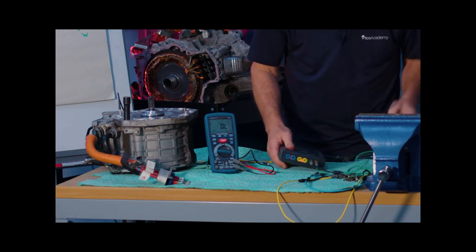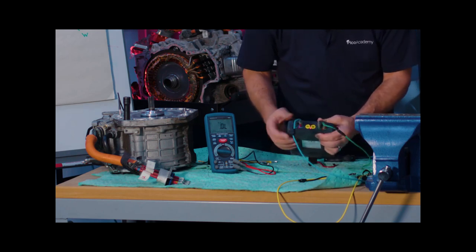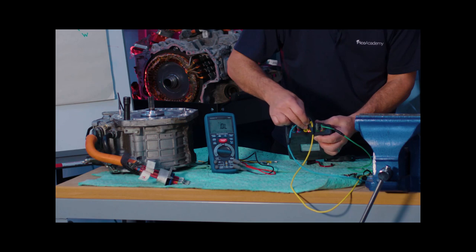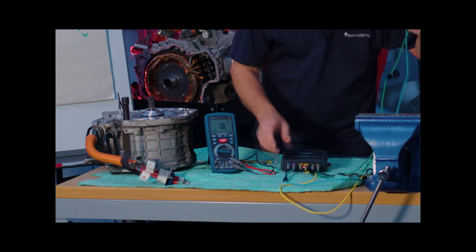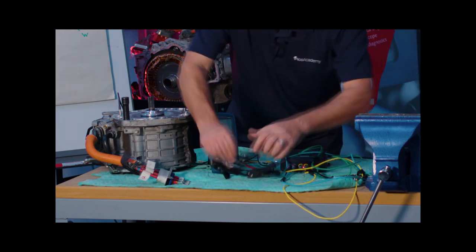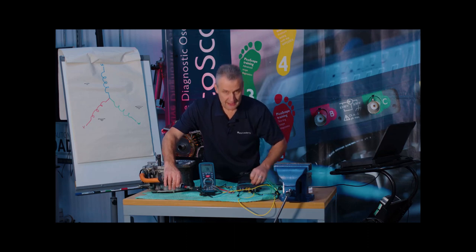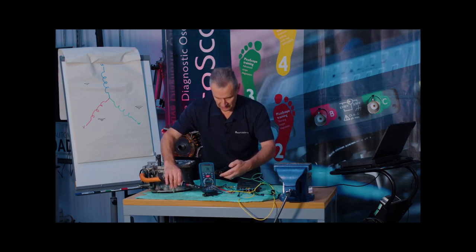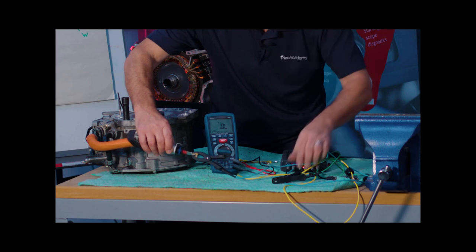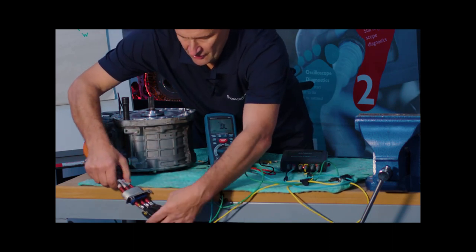This is going to be a four-wire measurement. We've got the red marker on the test lead going into the red 4mm connection socket on the device. We connect U, V, and W as labeled. Connection is paramount when doing this, because any connection error will result in an increase in milli-ohm resistance. Next up is V and then finally W.